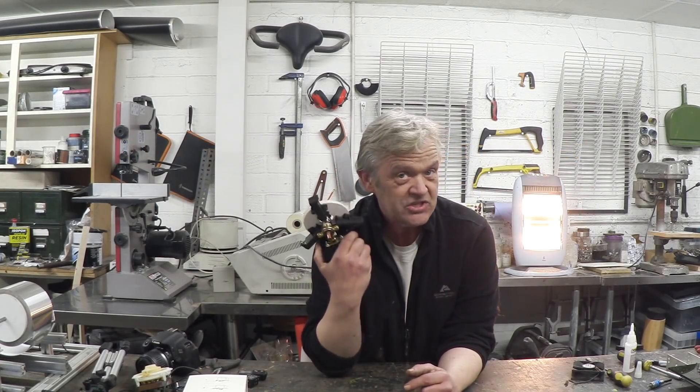In video 1017 I introduced this thing — it's a commutator, a mechanical commutator meant for externally driving brushless DC motors. What's the point when they can be driven by semiconductors really well? Yes they can, but only up to a certain point, and they are difficult to actually build unless you really understand the electronics.